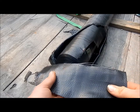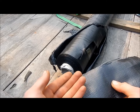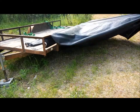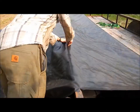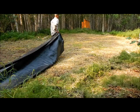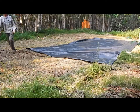This product is semi-permeable — the interlaced woven fibers allow water to permeate between them. There are products out there that are non-permeable, like a pond liner. There's also a similar product that looks like felt, but you don't want to use that for this situation. That felt fabric is not intended to be used in a tension environment like this woven fabric — those felt fabrics are intended to filter out sediments, something you'd use in a spring box or as filter fabric in a leach field.